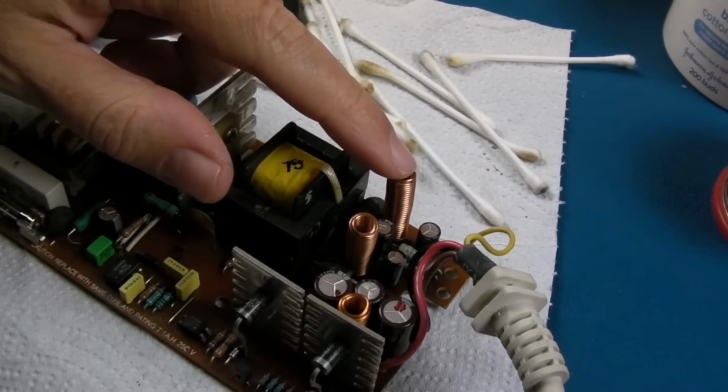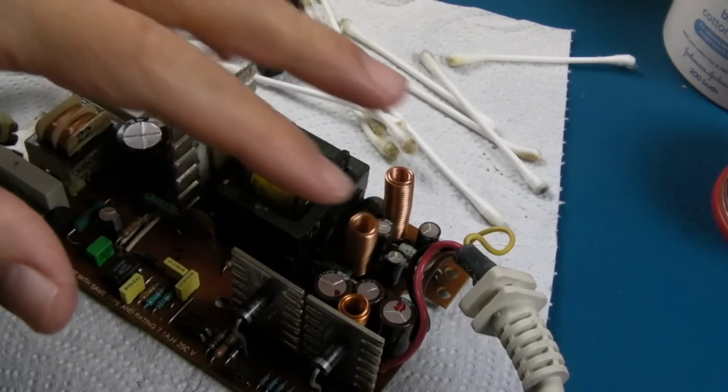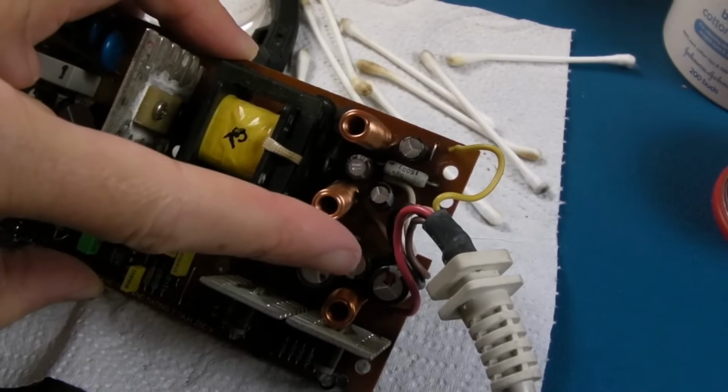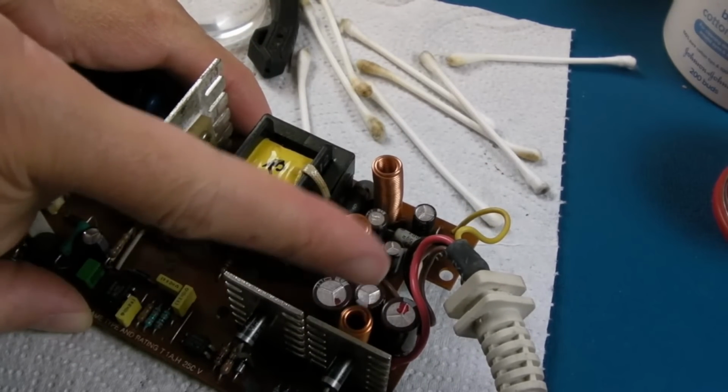You know, I don't like these springs. I don't like that. It's subject to vibration. There's a heatsink here with this diode on, this rectifier. Look, here, you knock your desk, anybody's guess what happens if that was to short there.